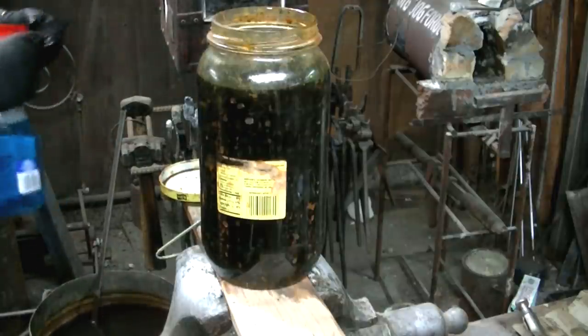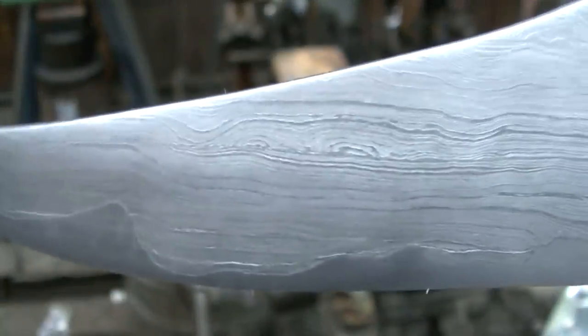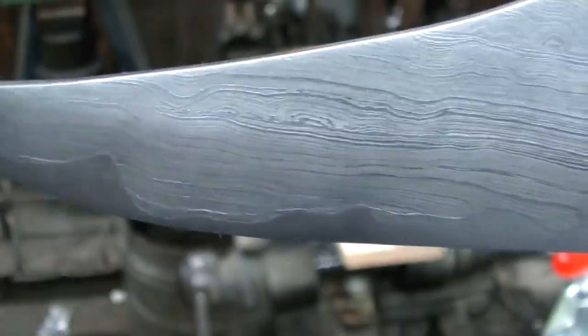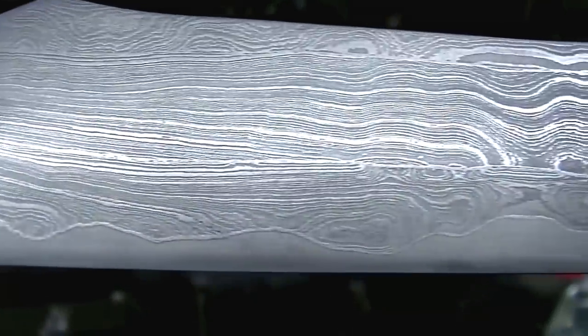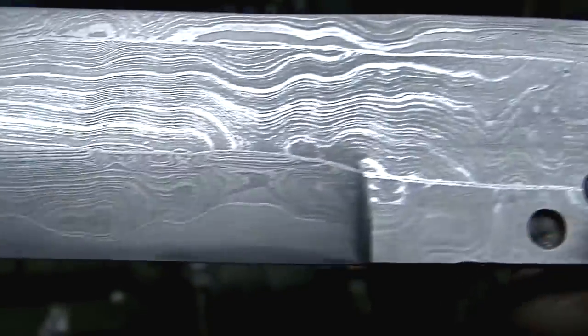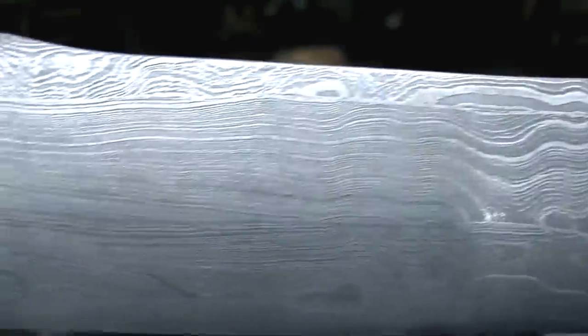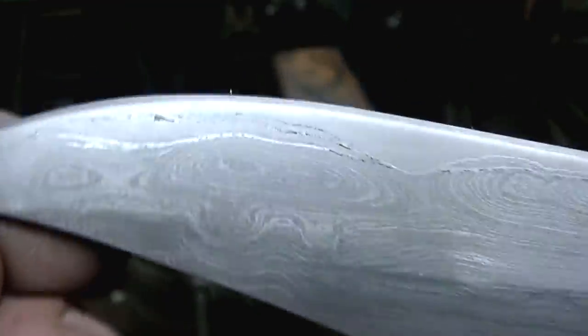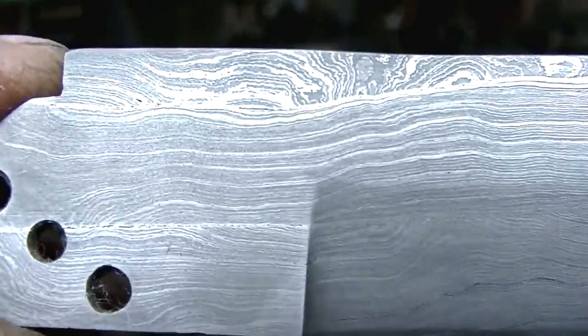All right, we're going to do an etch on this blade before our final assembly and see what she looks like. And in their document, they talk about raising the vein on these. And this is what they're talking about. You can see those veins of steel running through this. And remember, this is mild steel barrel bands. It's old files and cast iron powder between every layer.